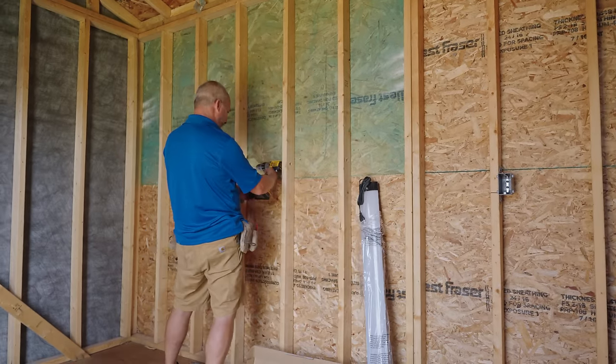Here's our plug. Now the reason these boxes have a trap door is so that you can bring it through conduit. You can do connections, wiring, Marettes. This can be a connection box. It has to stay exposed, and then you can push it in a different direction.